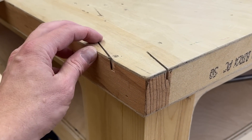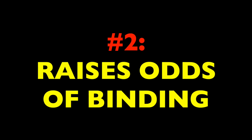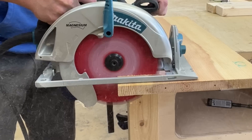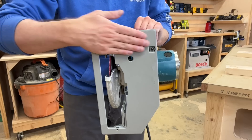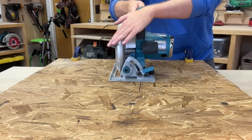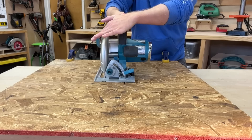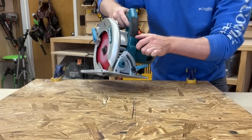You don't want any uncontrolled cutting with a circular saw. It damages surfaces and it increases friction, which leads directly to problem number two. Having this much blade penetration raises your odds of binding, because more blade surface area creates friction in the cut walls. If you twist this much exposed blade, you can get a really big kick. And this is very likely because of problem number three: a loose plate decreases stability. The bottom of the flat sole plate is smooth and wants to slide around, so if you don't have a fixed pressure point, the saw gets squirrely really fast. Because of this, you can easily twist the saw, get more friction on the exposed blade, bind up, and then kick.